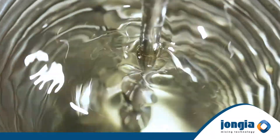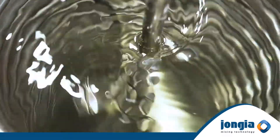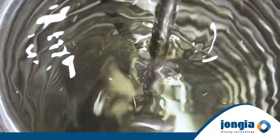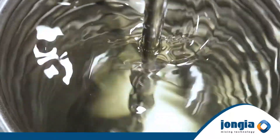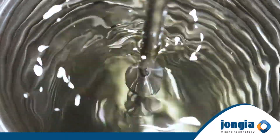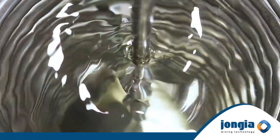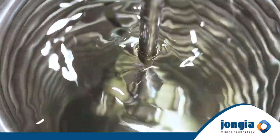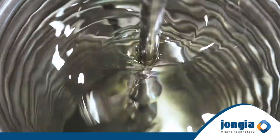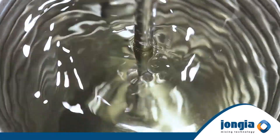During the process the crystals will bond with the DM water and become crystal water. If this process is running at too high a shear, the crystal water will become turbid and undefined particles of crystals will form. However, we want a uniform homogeneous crystal size, and to reach that it is very important that the agitator is running smoothly at 275 rotations.